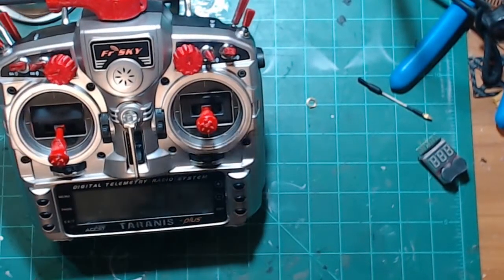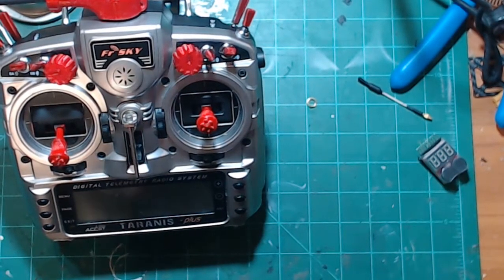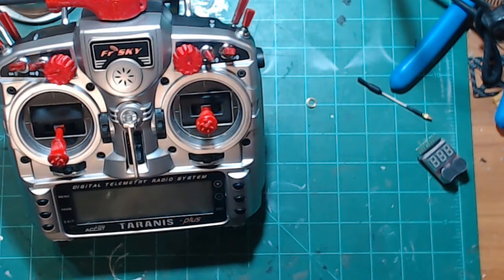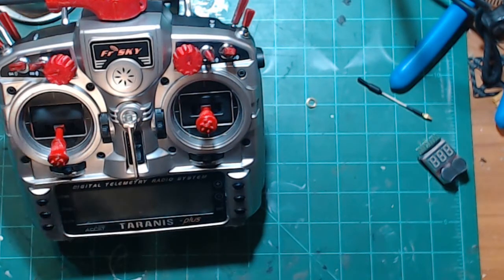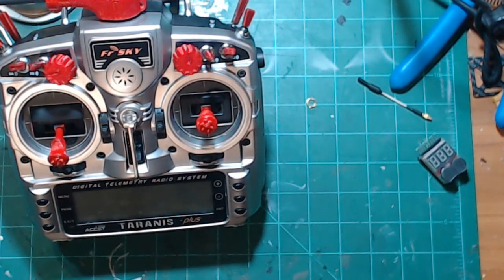Yeah, just go to Painless360's video, watch his video, and he has the recordings right there too that he set up. They're a little long because it says like Crossfire telemetry mode 1, Crossfire telemetry low. They're kind of long, so you can tailor them down a little bit if you want to take the time, using Audacity or whatever, to make your own alerts that are a little bit less annoying. Or you can always just tell it to play the value. You don't have to have it play the track. You can select on here to play the value whenever the logic changes, which is pretty cool.